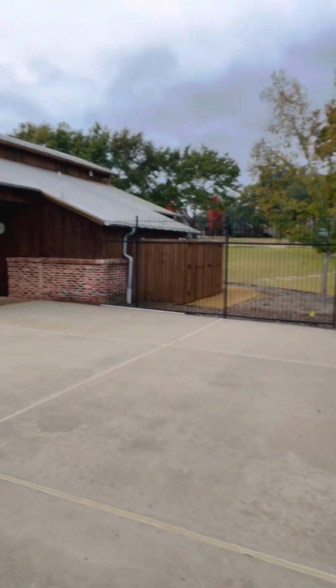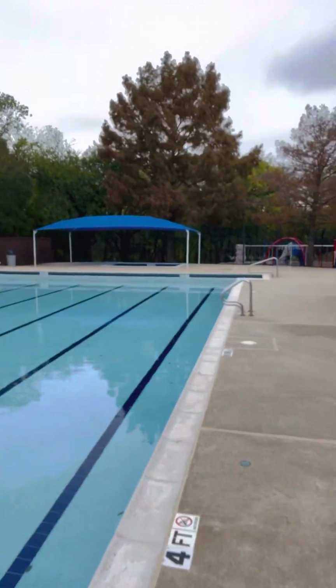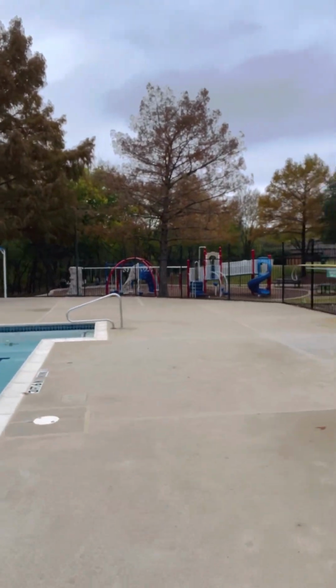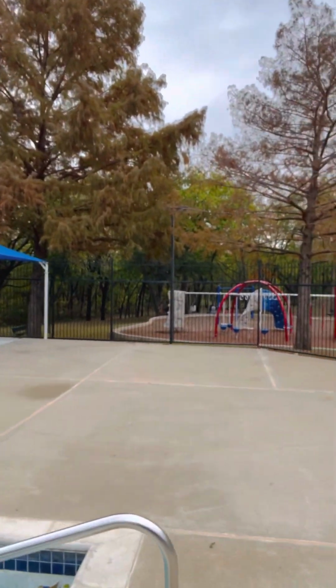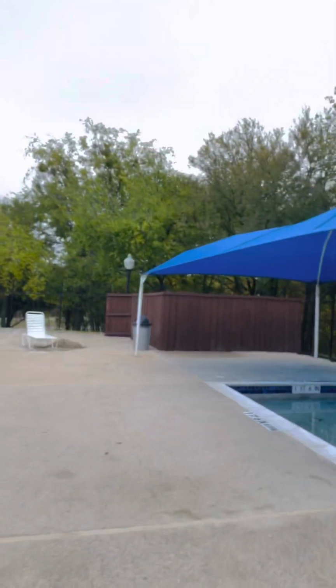And then you might as well just close your business down, because you're building a new pool for a customer, and that is not fun. I never had it happen to me, thank God, but we have to make sure we don't do that. So this is an exception because there's a really steep slope down toward that drain in that creek, so I'm fine with it. It's gonna go over there. There's no way it's coming back up under the pool, so it's okay.